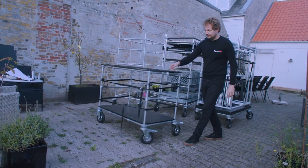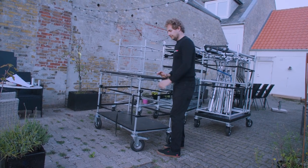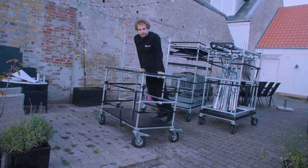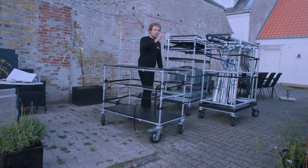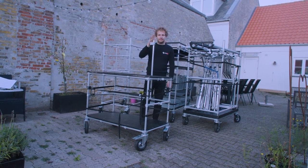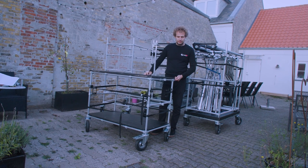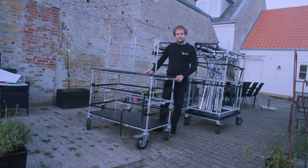On the side I did the same so we can have a static mount when needed — the table is absolutely sturdy and nothing will tip with heavy weight on either side. Two recommendations: you need to glue end caps on the pipes with power glue because they will come loose when hit. I would also recommend using Loctite for these types of screws because they can come loose under vibration.